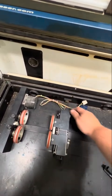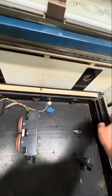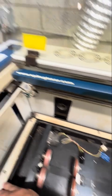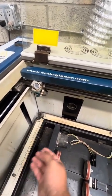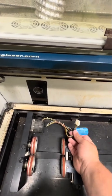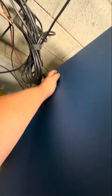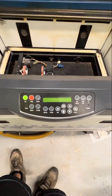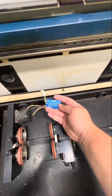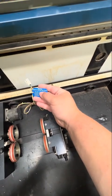Make sure your wires are not pinched. Now this is very, very important — make sure these sides are down, because they can hit your laser head if they're up, depending on how high you are when you're engraving. And now, super crucial: before you plug this in, make sure your laser is turned off. Hit the switch on the side to shut it off. It even says on the unit specifically not to plug in unless it's turned off — it can cause electrical damage.